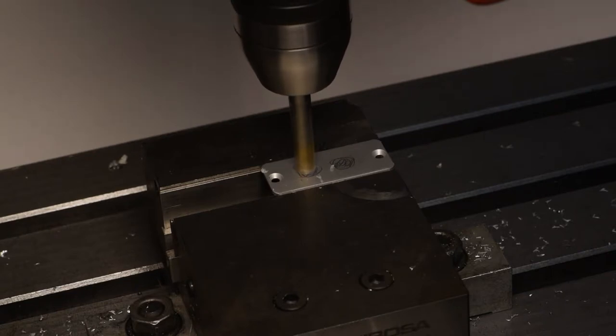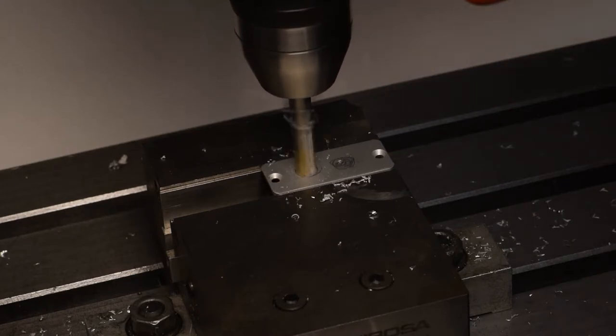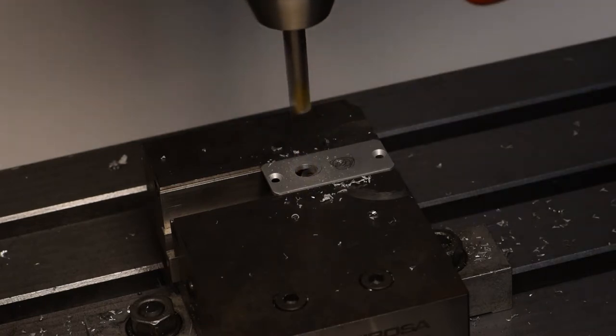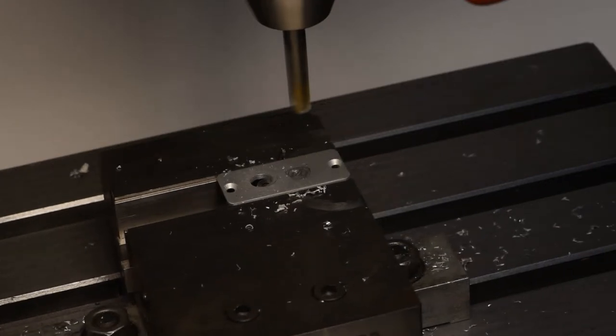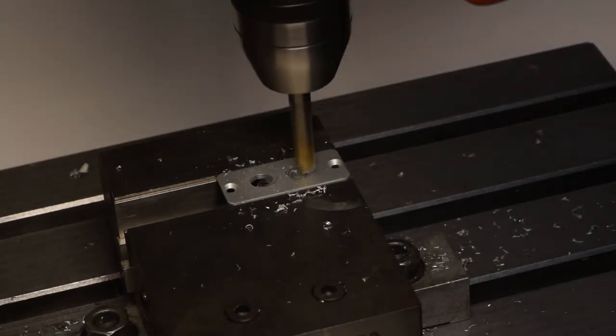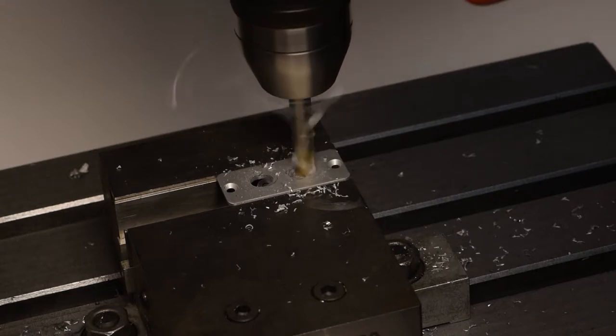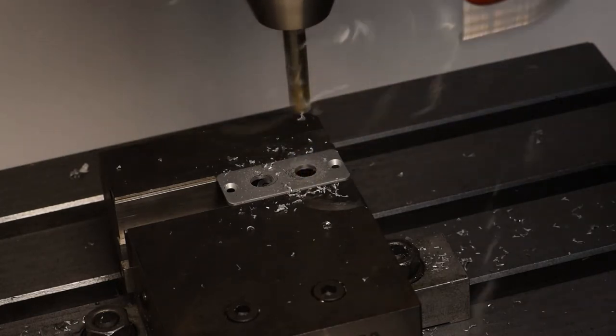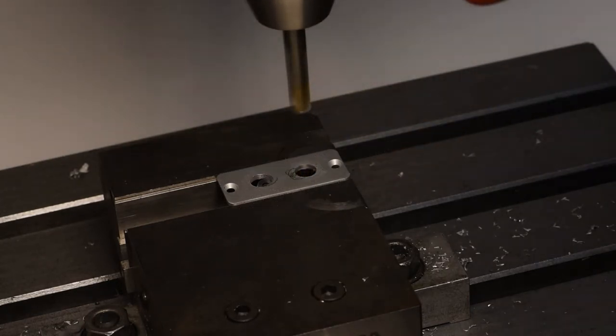Again, it's important to figure out the diameter of a drill which you need. It's going to be the same diameter as your BNC connectors. And of course the holes are going to be round, which I know is not the ideal shape for a BNC connector. You'd want D holes, but there we go. The limit is not just given by convenience for the drilling, but also by the fact that we will need to hold them into place somehow, and you can basically not turn the nut of the BNC connector.